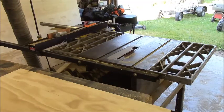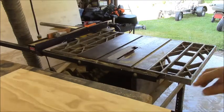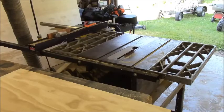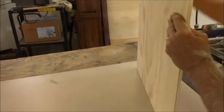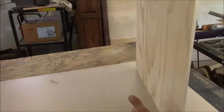So now the next step is I've got to straighten this back out, and I can put the dado back on. And then we're going to cut the dados. I've got to cut the notches in here for the toe kicks. But see, this is weird because these are coming out this way, and the other toe kick is coming here. And so this one, I'm just not sure how I'm going to engineer how I cut the ends of these. So maybe I won't cut them right now. I'll just cut them when I start putting it together. I can always notch them out with the saber saw. It's not a big deal.